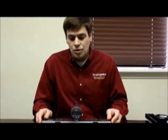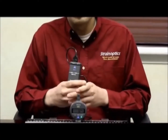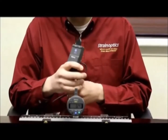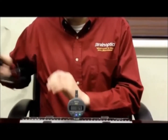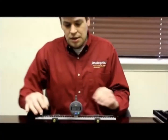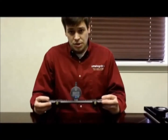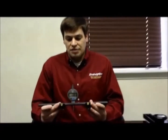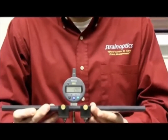It's also able to have an input tool attached to it, which will allow us to automatically put measurements directly into an Excel document or a Word text document. And lastly, the three-point contact gauge can be used to measure local distortion by pushing our contact feet in as close to the center of the gauge as possible.